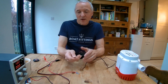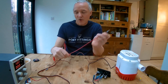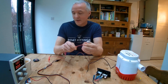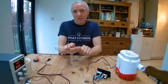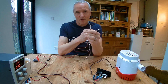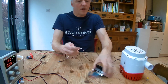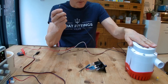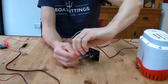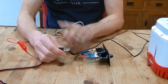I've prepared a bit of wire to give us more room, and I've prepared a positive feed wire with a spade connector soldered on — I prefer to solder rather than crimp because it's more reliable in the long run. I've also put soldered spade terminals onto the bilge pump's two positive feeds: the stripy one was the manual operation wire and the non-stripy one was the automatic operation wire. Now we're going to put the negative feed from the bilge pump together with the negative from the switch panel, then connect those to the negative feed from the battery.